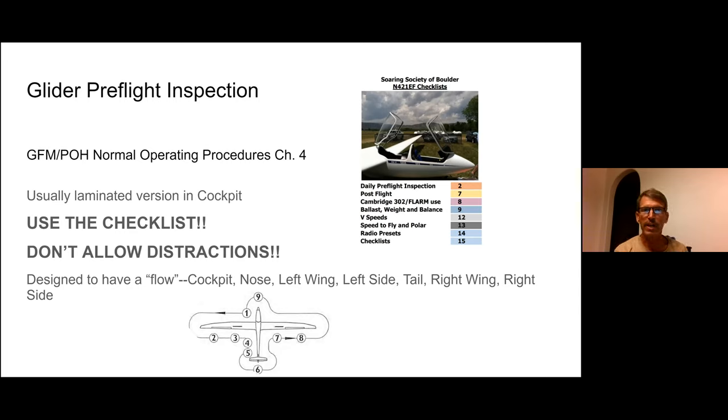Just about everybody I've seen who lands without an airspeed indicator comes in a little bit hot. They come in a little too fast and use more runway and have to push back, but hey, that's no big deal. That's a lot better than stalling short. So there's nothing you need other than your eyes and your ears and your hands and your feet to land safely with everything gone and all the instrumentation gone in a glider.